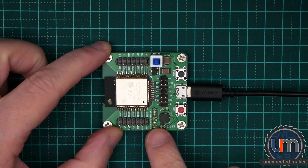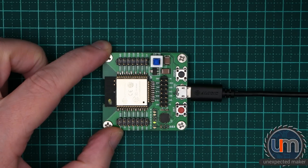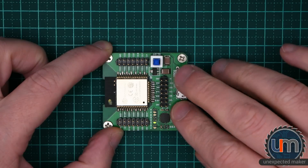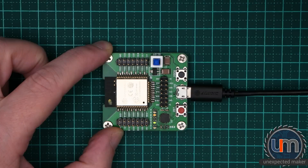Straight away we can see there's a little LED that's turned on. I'm going to lean over to my computer and set up a blink sketch. I don't even know if there's an LED on pin 13 — I'm hoping there is. I'm going to select this as a straight up ESP32 development module. Compiling right now — and off it goes programming. I'll start the sequence with my buttons.